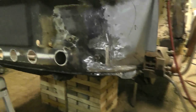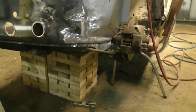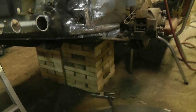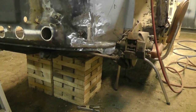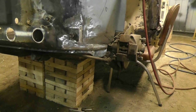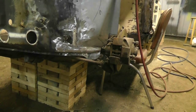So I've welded this in, ground it all down. It's all welded in here. I actually welded it on the inside as well, just to make it more solid, because my plug welds weren't working very well, I must admit. I might have to try a different technique — maybe I'll sit down and drill some holes in some pieces of metal and see if I can figure out how to plug weld it and have it melt through properly, because it really was only melting the top layer.